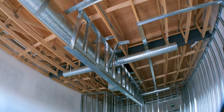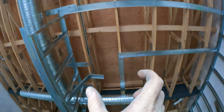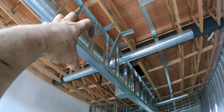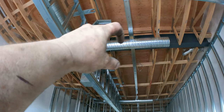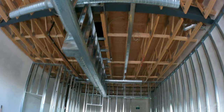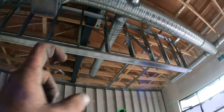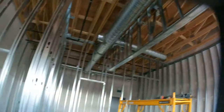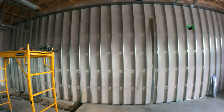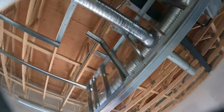Working away — I got one bulkhead done and now I have to drop another one. I put all the top track on first, and you can see how it comes here and down. I'm also putting the track on the ceiling section so when I come along doing this one I don't have to brace it — I just measure across and put a stud in. I've got clips up in there to carry the bulkhead.